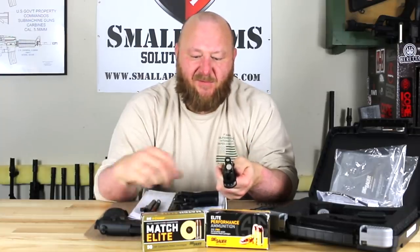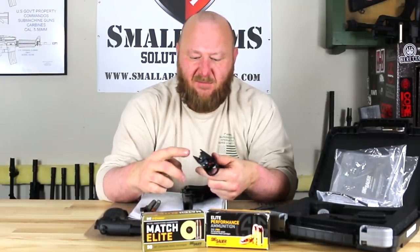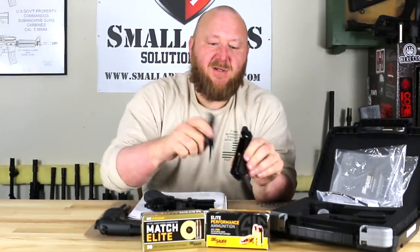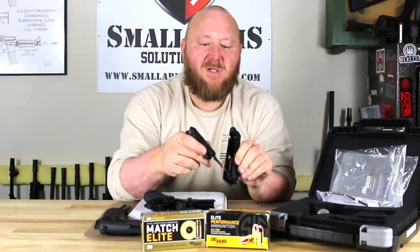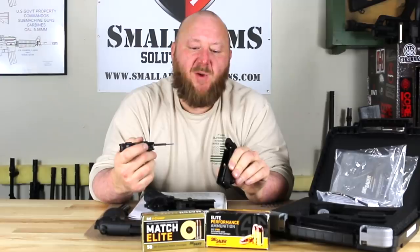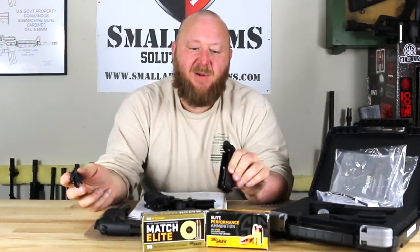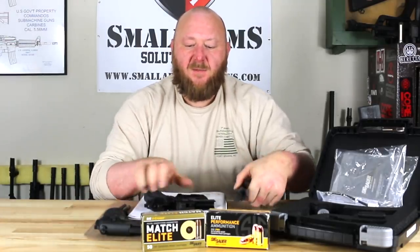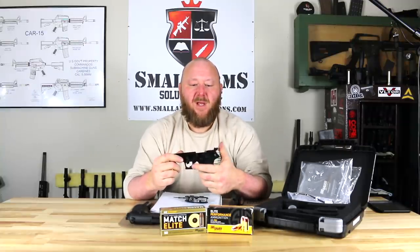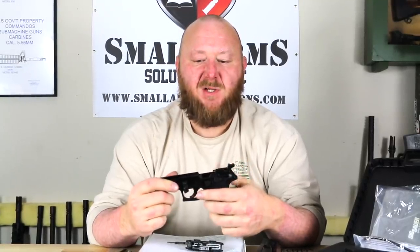As far as safety is concerned, you have a four-point safety system. First, the firing pin safety — a spring-loaded plunger that locks the firing pin in the rearward position until the trigger is pulled all the way to the rear, at which point it lifts up and allows the firing pin to strike the cartridge. You also have the decocker, and additionally the hammer is set up so that it does not rest on the firing pin, which provides an additional level of passive safety.